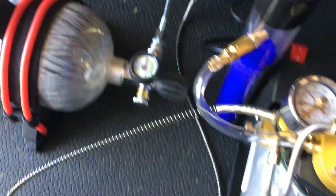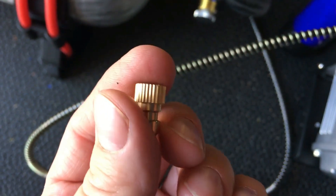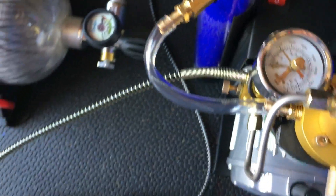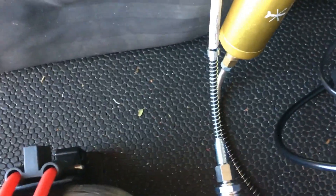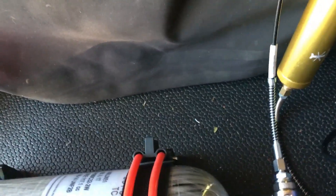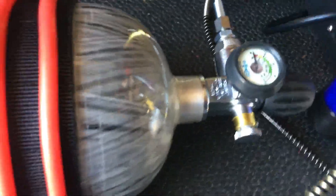I tested the seal across all three filters by installing an end plug, so I was sure I was getting pressure against the compressor. Each time I plugged into one of the stages I checked the compressor gauge to see it was going up. When I connected everything and ran for the first 50-bar test - about 11 minutes - everything was good on the tank, the compressor, as well as the water. I stopped when things got up to almost 60 degrees Celsius.